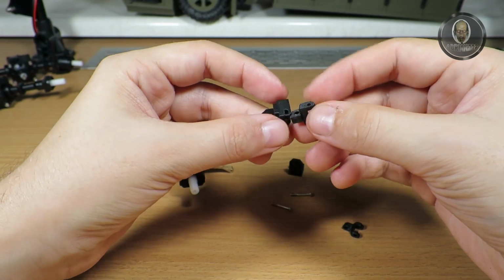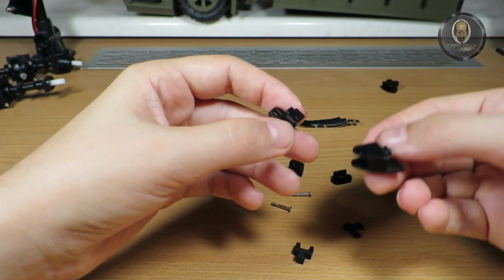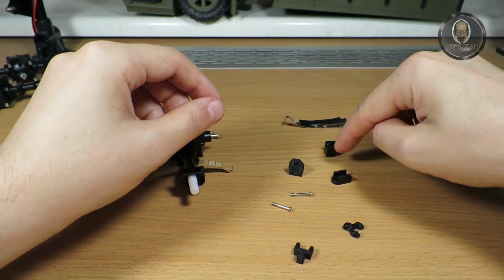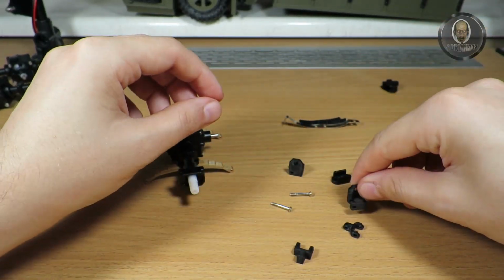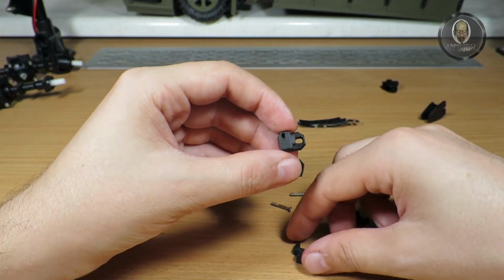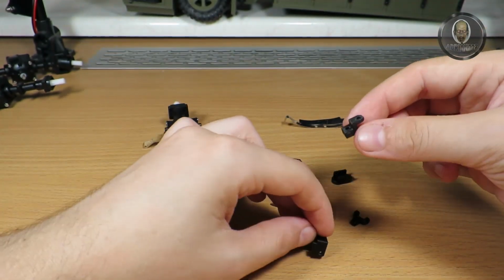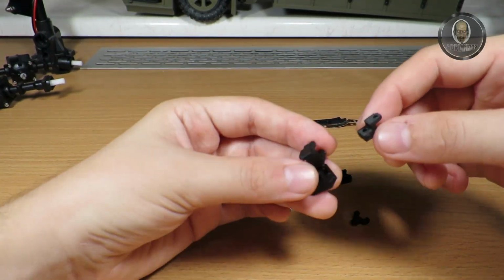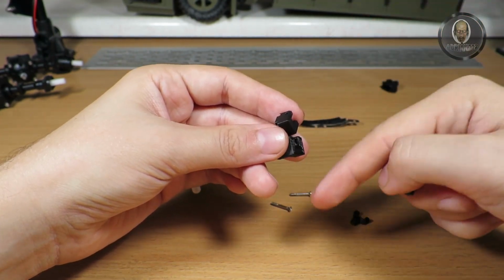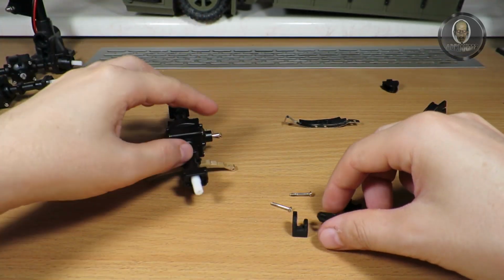I could make this as one piece, but this little part in here will hang in the air, and that will make it hard to print. That's why it's printed like this, and this worked so far. That's why I did it as a separate part. Also, you may select if you want the solid part on the front or on the back, and same as the moving part. So this is a much more convenient design.